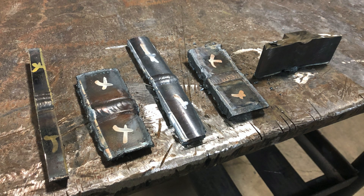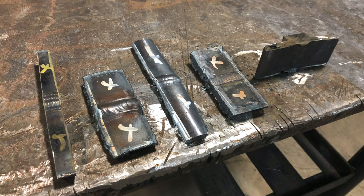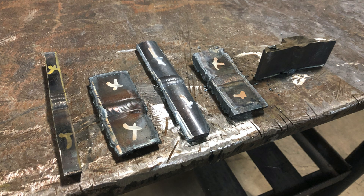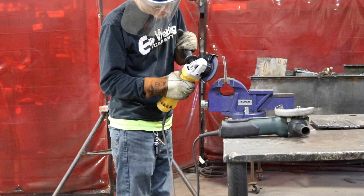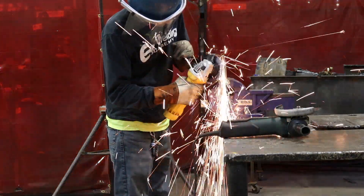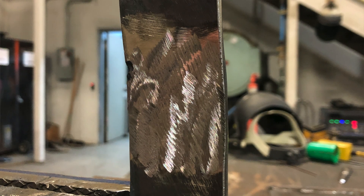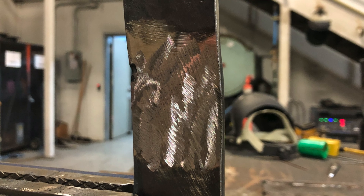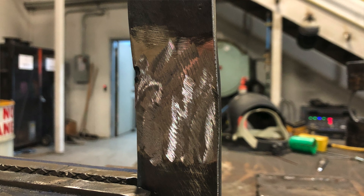Here I have all my test strips cut out. Some of them I used an oxy-acetylene torch to cut, which we'll go over in another video. We still have to flush out the roots and the caps, so let's go over the specific grinding disc for that task. First up is the four-and-a-half inch by quarter-inch grinding disc — this is the thickest disc in your kit. I'm grinding off the root and cap, shooting the sparks at the floor, wearing all proper PPE. Once you've ground off the root and cap, the coupon should be flushed with the base metal without thinning out the center weld zone.